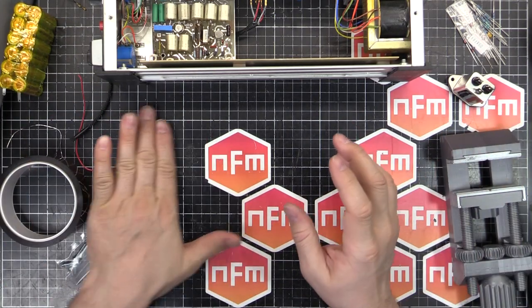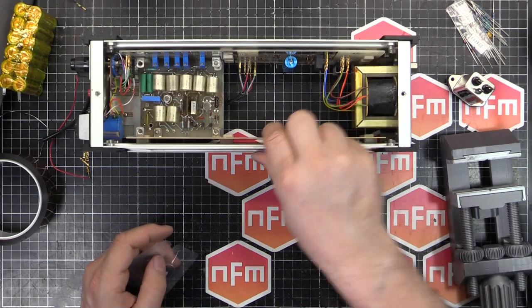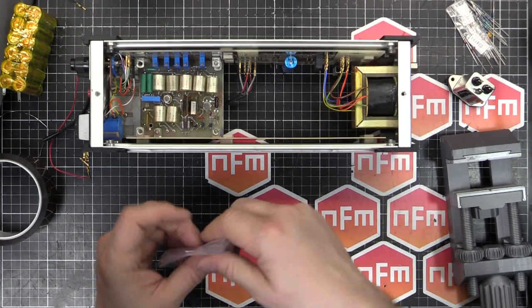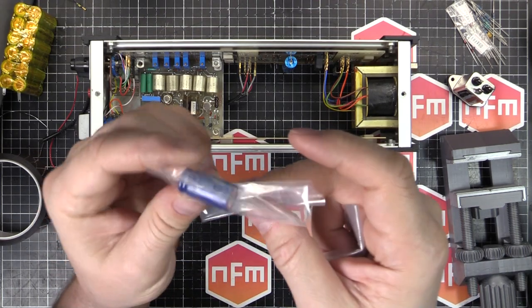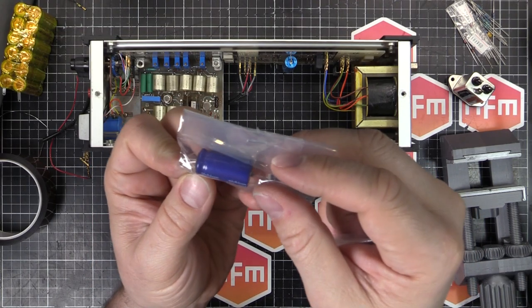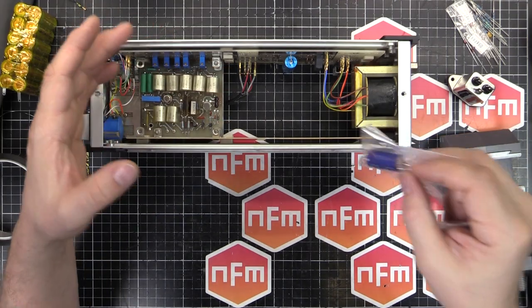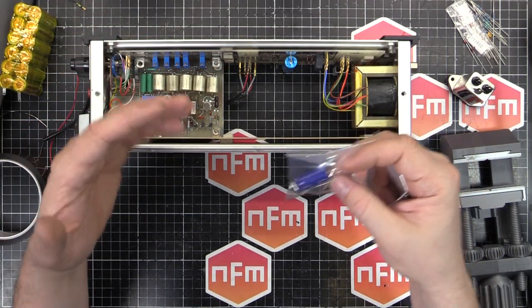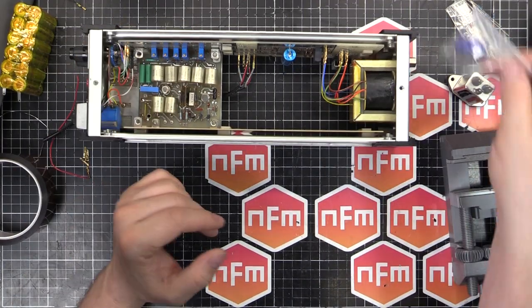Next, when I was at Akihabara, I also went and bought some extra bits. So there's an electrolytic capacitor here. I haven't tested it, but I bought a new one, a new Nichicon VX series. Nice capacitor, axial. This one's actually 220 microfarad, whereas what's in there is a 150. Power supply section, the more capacitance, the better, generally speaking. So that'll be fine to plonk in there if needed.